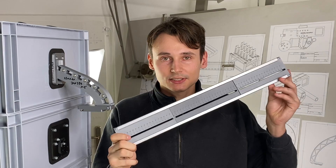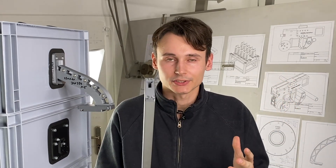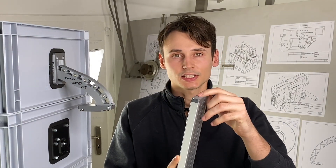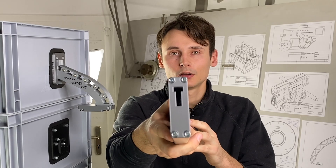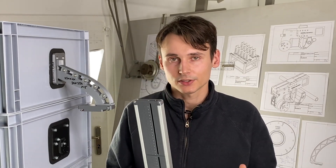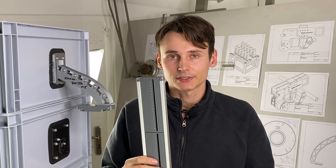Attached to it is this magazine which serves mainly two purposes. One is as a buffer and the other is to relocate all the screws together from all the different feeders so that they can be dispensed at one location. In cross-section it has an opening where the screw enters and is completely constrained all the way through to the dispenser.